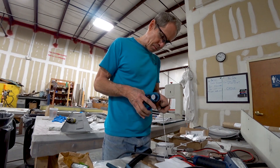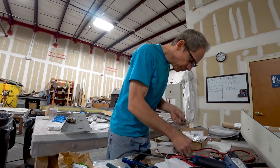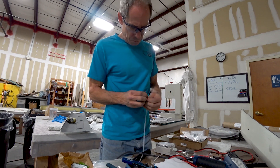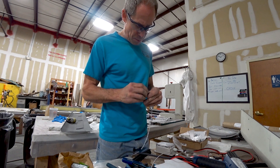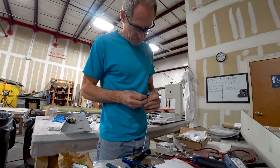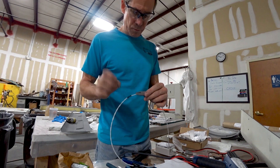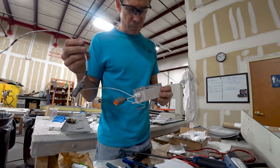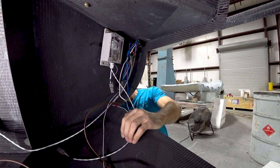I got the first connector done on the Arduino - the one that receives the power. Now I'm creating a little pigtail with the opposite male-female connector that will actually bring the power in, to be spliced into the power cord I ran to the left side baggage compartment. You can see the connector done, and it plugs into the Arduino connector and mates in nicely. I made sure to get positive and negative the right way around. The other connector on the Arduino is for the sensor wires for pressure and temperature coming off the engine.